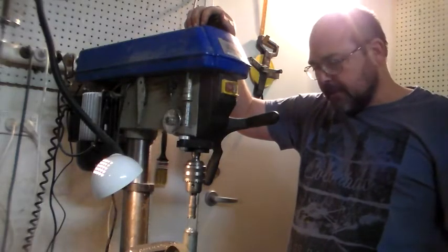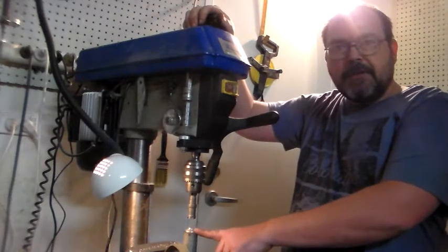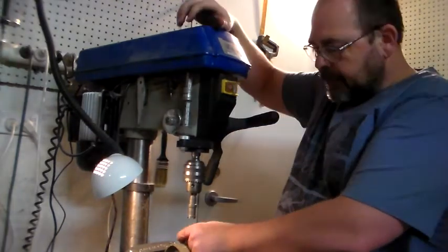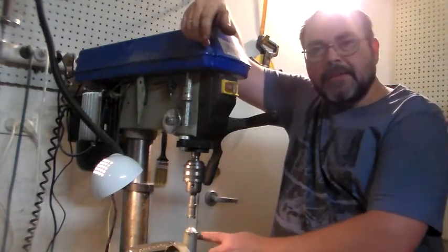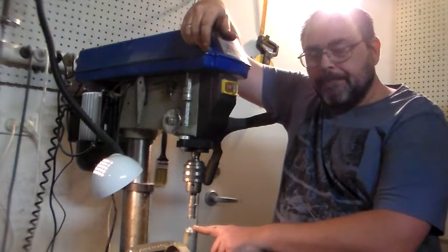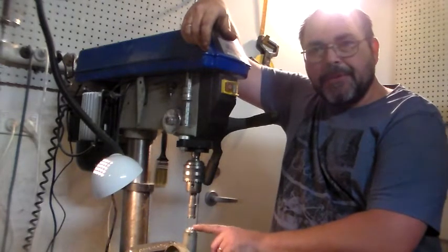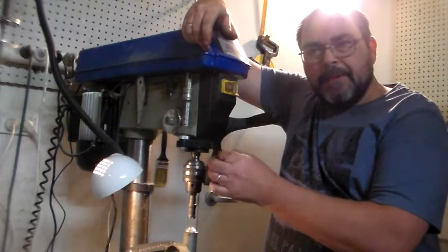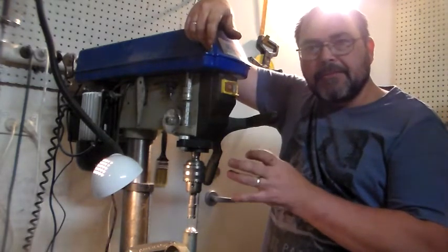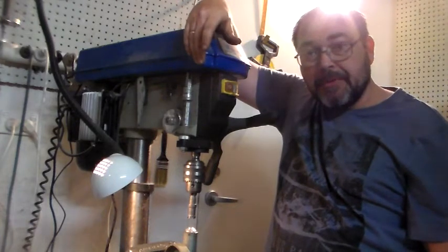It's eight o'clock at night and I couldn't get this off my mind - the nozzle ending I did today. I'm just not happy with it. The molten plastic is going to be injected under load and you need to hold it under load while it sets. My concern is that unless I get a really snug fit between the tip of the nozzle and the port where it meets the mold, if there's any room for the plastic to escape, it's not going to hold pressure. I don't have any experience with plastic injection molders.